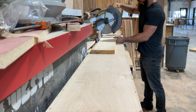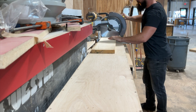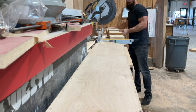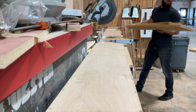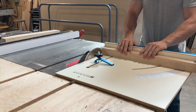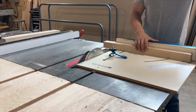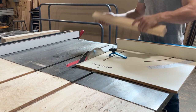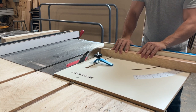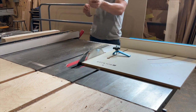I'm not going to walk you through the milling process a third time. Here's what you need to know: the legs are milled to two inches square, 24 inches long, and all other components are milled to seven eighths of an inch thick. You can get the dimensions on the file I'll provide. Just make sure everything is straight and square, because all of your joinery on the Origin is going to be referenced off of those edges.